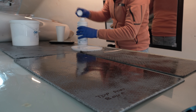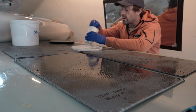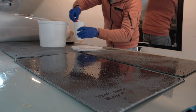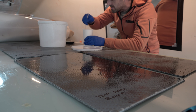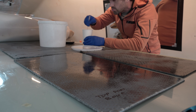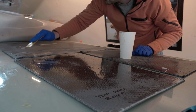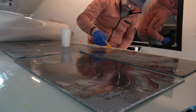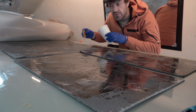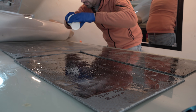This is a coating epoxy resin that doesn't need to be covered in order to cure fully. Silica powder is a pretty common thickener for resins. I'm giving the epoxy a really good stir all the way to the corners before I pour it out onto this slate here so I can add the silica and turn it into a paste. Almost more by luck than judgment I've got the consistency perfect straight away - that was three capfuls of silica powder straight into about 140 grams of resin. It's given me a nice gloopy paste. I'm being a bit blasé about the thin paste at first, covering all the areas needing more flatness, and then by the time I noticed the first signs of gelling I made sure the surface was reasonable, as leaving ridges only means more sanding later on. The resin is starting to slightly gel so I need to speed up, but I'm nearly done.